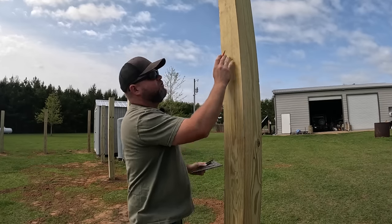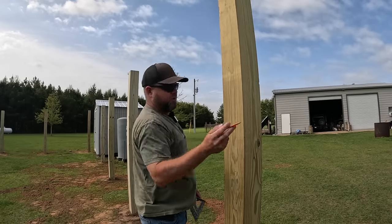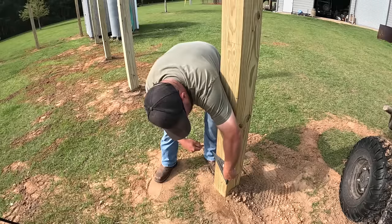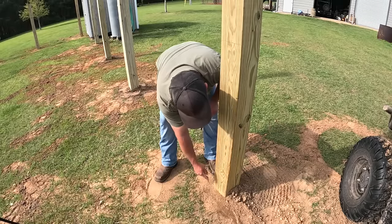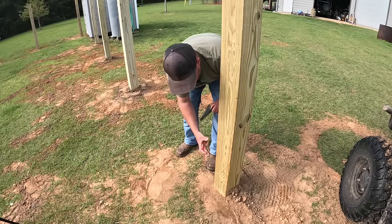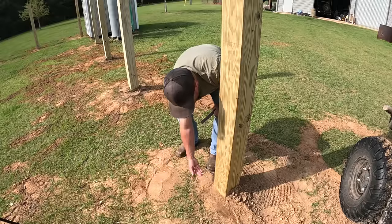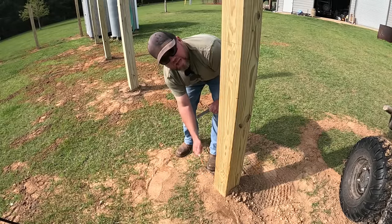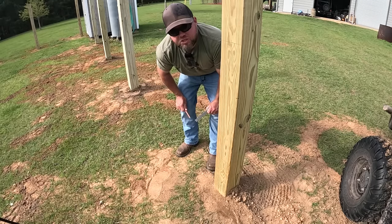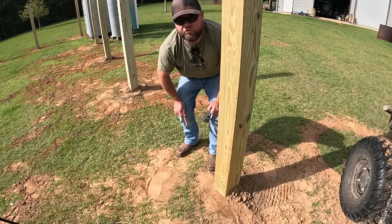Now that I have these marks I'm just going to draw lines. I know I'm going to put my horizontal runner right here and butt it up to the top of this line. My six-foot panels are going to go up to here, but I'm stopping my horizontal runners below that because these have dog ears cut off the panel — I don't want to see what I'm nailing into back there. We're tucking everything from the bottom up, top down, and one in the middle to keep our fence panels from bowing. I do not like lumber touching the ground — even though this is treated lumber, it still has the potential to rot out if you put it in moisture on the dirt. This is not heavily treated lumber.